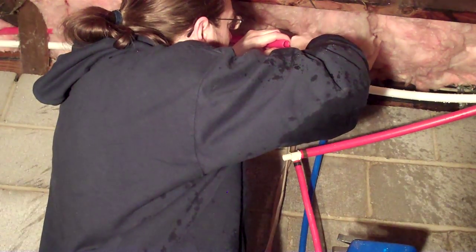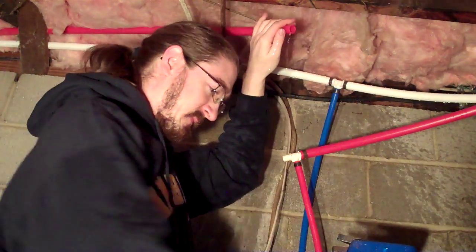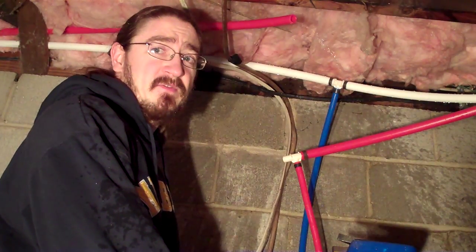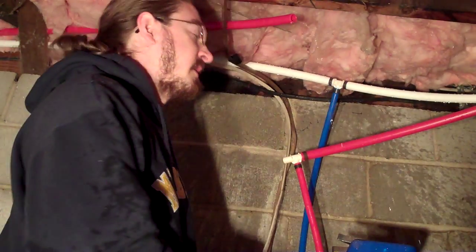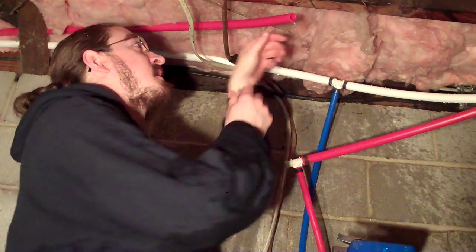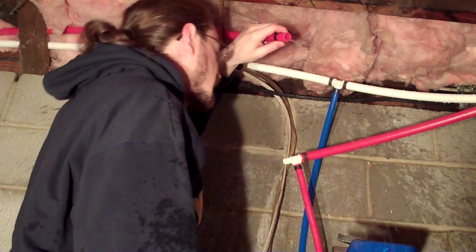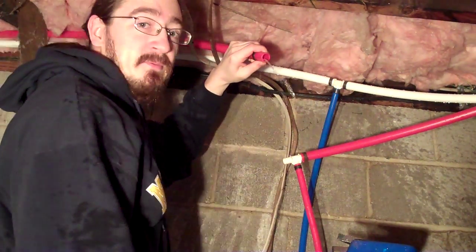Trim up this edge. As I mentioned in one of our other videos, we have a faucet upstairs in the tub and the valves are leaking — this is the cold water that's coming back through the empty hot water line. It's ordinarily not a problem if both the hot and cold water have pressure on them, but with only one connected, it rains on us.